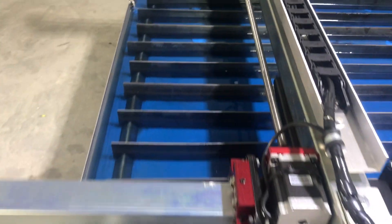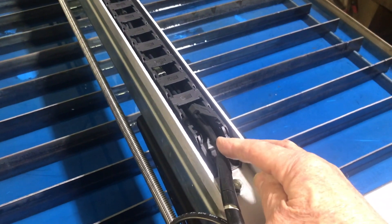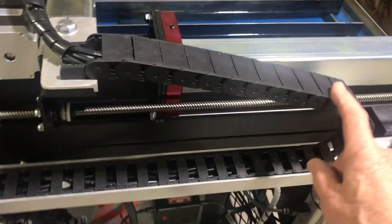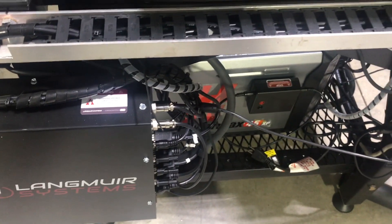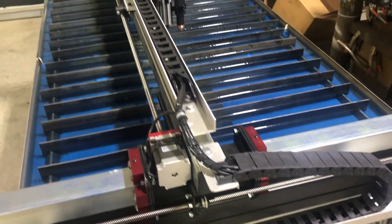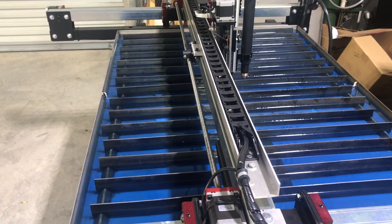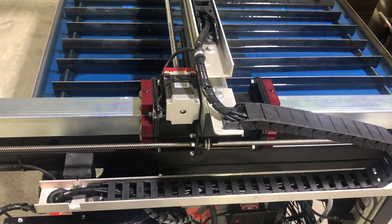The final wiring has the two wires along the long rail — the initial height sensor and Z axis motor — combining with the X axis motor wire, making three wires going through the drag chain, down through the opening, and to the electronics box. I think these chains really help clean up the look and are very functional. One thing I've wondered is whether I'll get water in the channel — I could drill some drainage holes, but so far I haven't seen any issues.